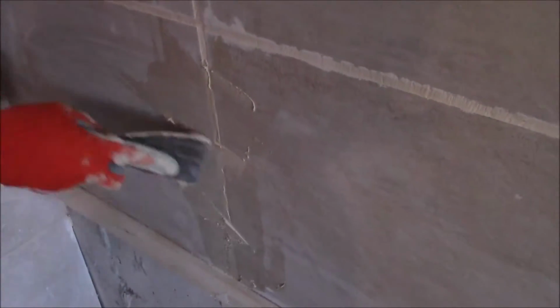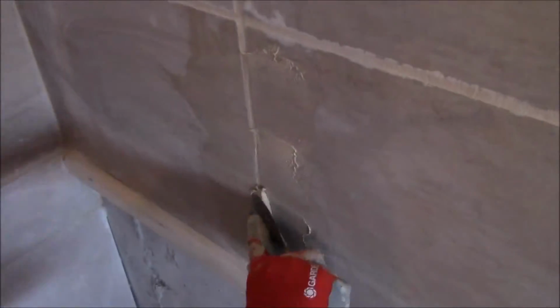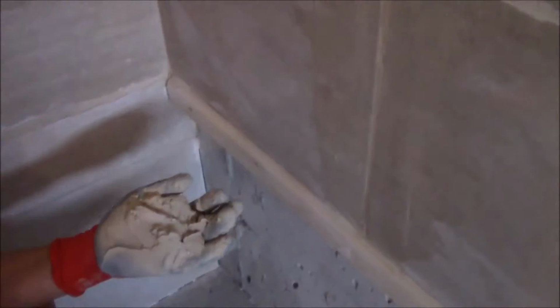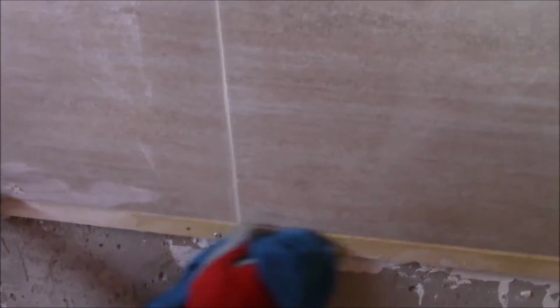Use a trowel to spread the grout across the tiles. Be certain to get it between each tile. When the grout is in place, wipe away the excess with a damp sponge or cloth. Repeat this process several times, being careful not to remove the grout lines around the tiles. Do not be scared of the big mess that you made. It cleans up really easily with a wet towel. Just be patient, repeat it two or three times, then it comes clean and nice.